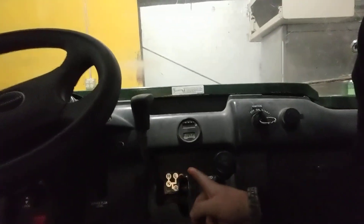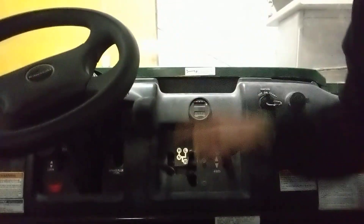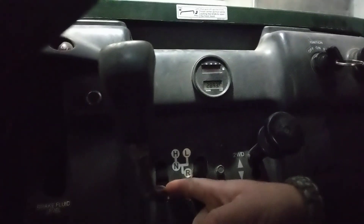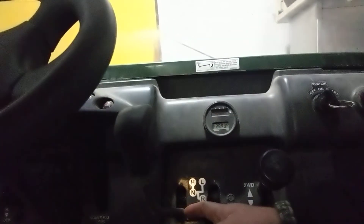This one has been running for us for about two years almost flawlessly, which I hate to jinx, but it's been a godsend because the first four years we had it it's just been a nightmare. The other thing that sucks on these is the shifter is steel and this plate where the gates are is all steel as well. They do rub when you slide them around and will rub through one another. This gets grooved out a lot — we've actually been through two of these because they get slotted out, and it'll pop out of gear, grinds gears. It's usually not very happy to go into gear anyway.